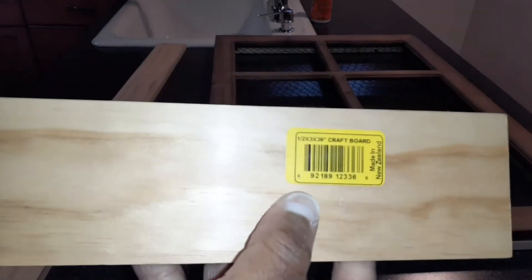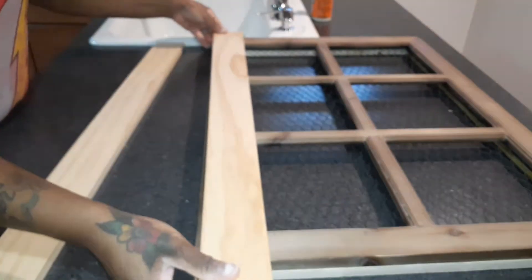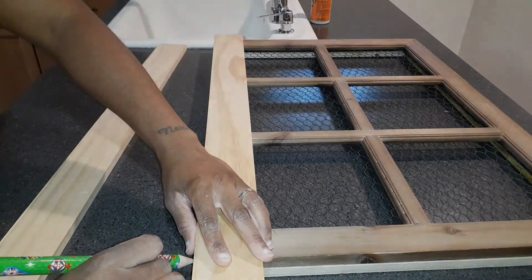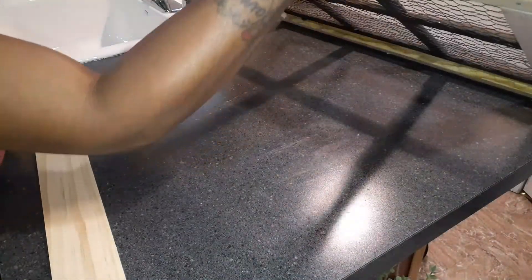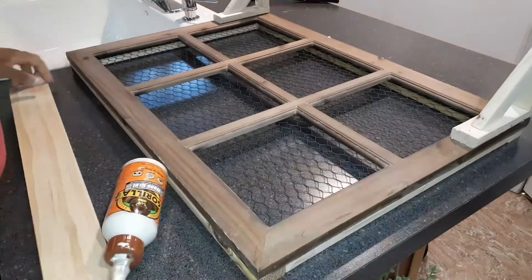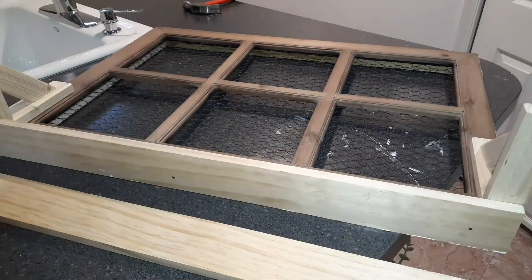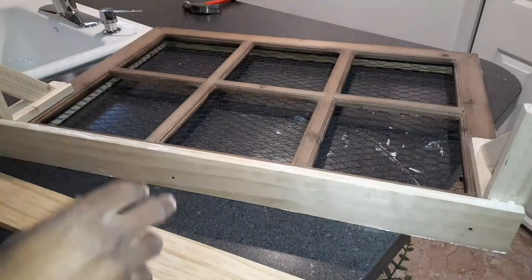Next, I'm taking some craft board — three pieces that I got for about $3 — and these are what I'm going to use to create my shelf. I measured and cut them down because they were a little too long, then I started gluing all three pieces to my window, making sure the wood was touching that extra piece I placed on the back. I added nails to everything. I'll be honest — I didn't let anything completely dry in this video. The nails are what saved this from falling apart while the wood glue dried, but it's completely dry now and it's solid.